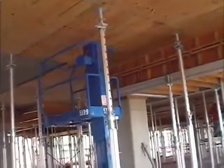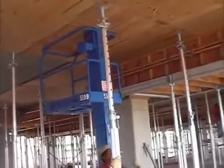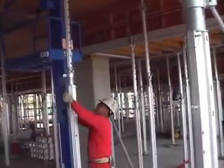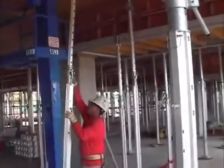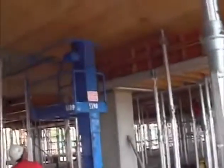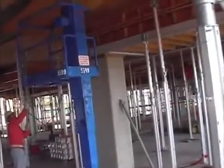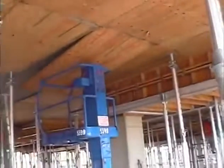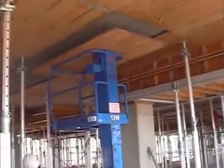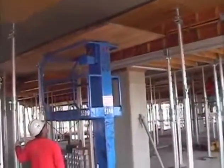It's best to have a two-man crew on the joists and ledgers and a one-man crew with a lift removing the plywood and re-snugging the post. The lift is raised to trap the plywood against the concrete, the post is removed, and then the lift is lowered four or five inches, which allows the plywood to be pried down and drop onto the top of the lift. The plywood lands on the lift, then the workman lowers the lift, removes the plywood, and goes on to the next bay.